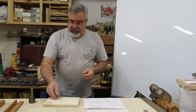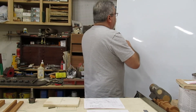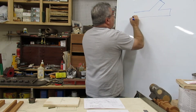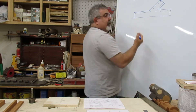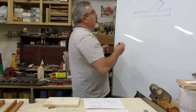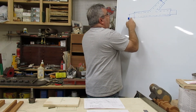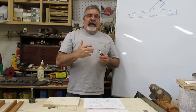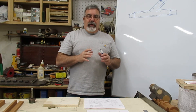These are core prints. Basically this is a little Y pipe — the dotted lines on the drawing are hidden lines, showing there's something inside. We're going to have a core print here and one out the back side. You've got to think a couple of steps ahead as much as you can when doing this stuff so you don't paint yourself into a corner.